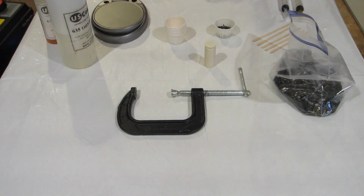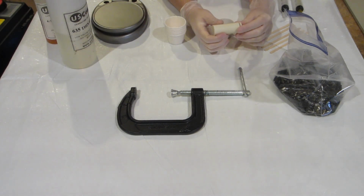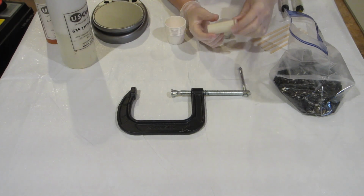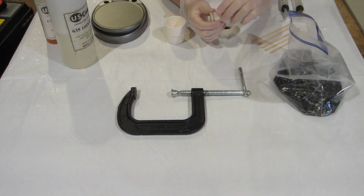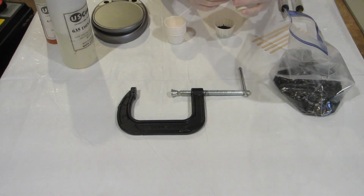All right, so welcome to the unscripted part of this, where we're going to actually be creating some composite parts. We're going to start with the compression molding of the tip of the composite nose cone we're going to be making. So this is a dissolvable compression mold made in ASA, and it's going to be what we're going to be using for making the tip.